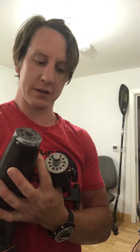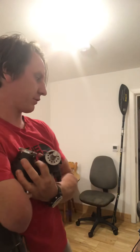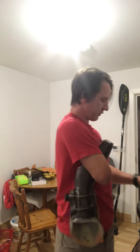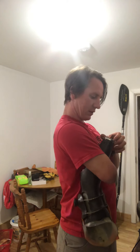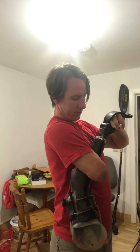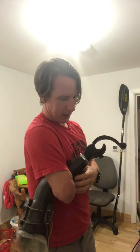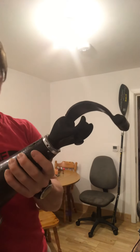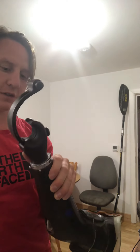The way I create the rotation is I take some of the holes and basically just get some burrs and join the holes together, making it so it then rotates, and the little lug snaps. But as I say it's not really designed to do that — it all gets a bit worn down, eventually comes loose and jams up. I've had a few slightly disconcerting moments in my kayak where that's happened and I'm trying to keep the kayak upright when I can't use my blades. A little piece of PTFE used as a washer there seems to make it last a little bit.